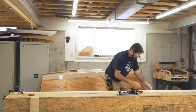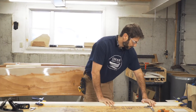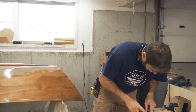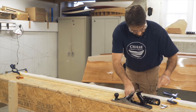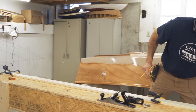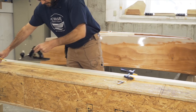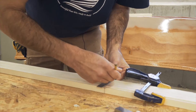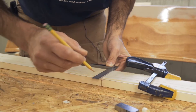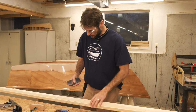So now I can see very nicely the wood that has to come off. We're going to take out the power plane and take a lot of wood away up here, diminishing as we go up to about the partner. So I'm going to take the square and go back to my reference staves, go to the stations, and square those lines across. The station markings are sitting right there on the reference staves.